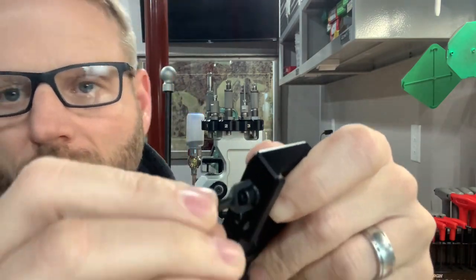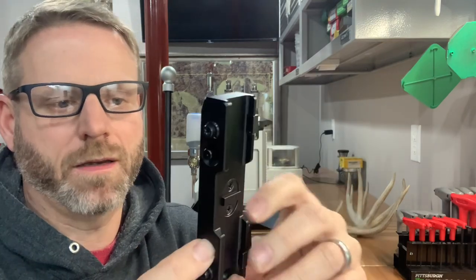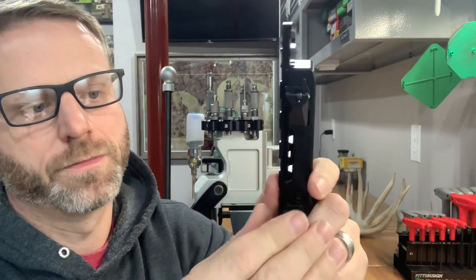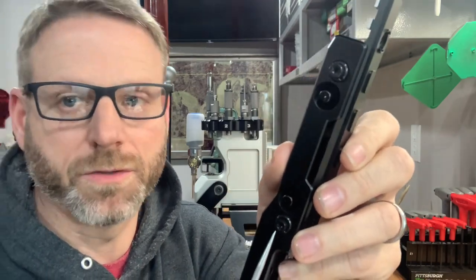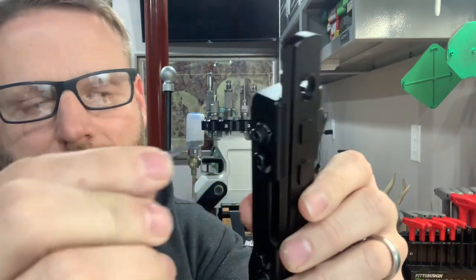and the inside portion is what you actually adjust the tension with. The way I recommend to adjust the tension is open the levers, put it on your Pic rail, close the levers with both of these outside lock nuts released, and remember those are backwards thread. With both of those released, take your spanner wrench and tighten that inside one up just until it makes contact.